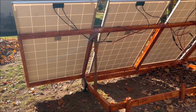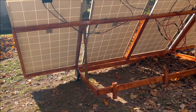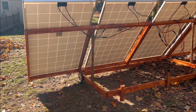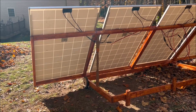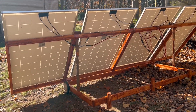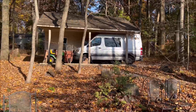The big thing I found is the Bluetti is able to accept the power, and even in November — when the sun is probably lowest in the sky — it was putting out almost 600 watts early morning. It's going to charge right up really quickly. With this much solar going into the Bluetti, from zero to 100% it only takes a little more than three hours, which is really good.